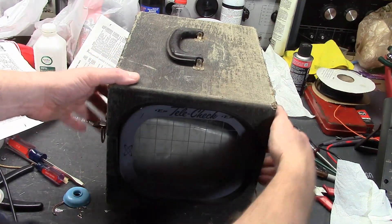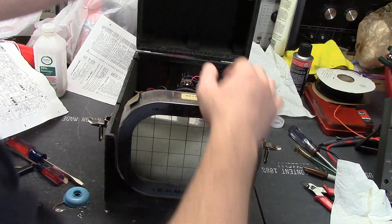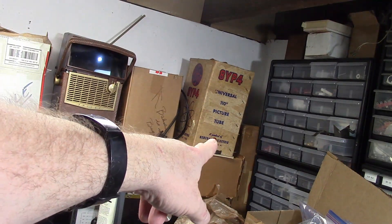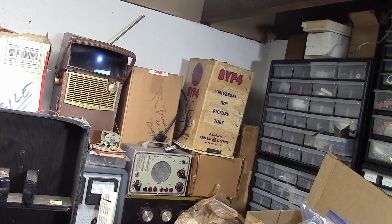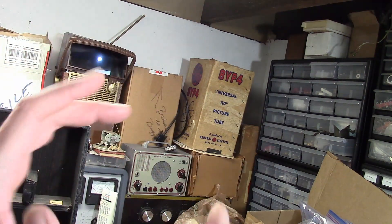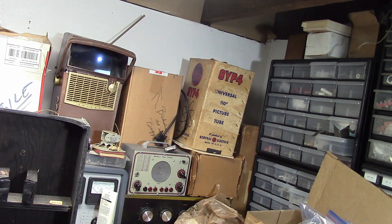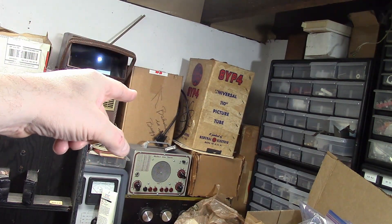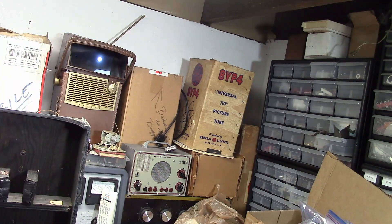What's inside of it is one of those little test CRTs. In this case it's an 8YP4. There's a family of three: the 5AXP4 is for the little round picture tubes — 10, 12, 16 inch round sets. The 8XP4 is an 8 inch rectangular but it's the old base style, the 12 pin, the big guy. And this is the last one of the family, the 8YP4, 110 degree deflection angle — just like Predictas — with the small little coin 8 pin base.